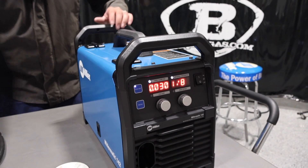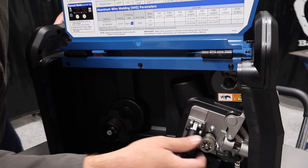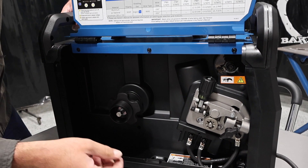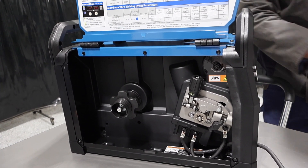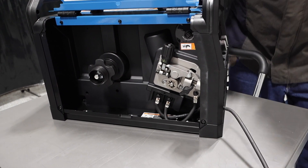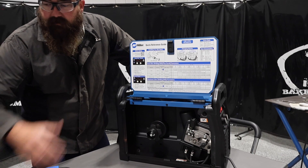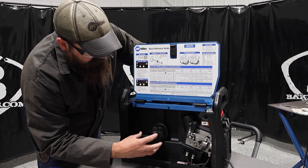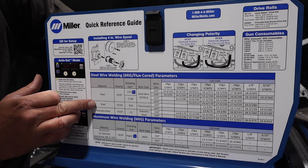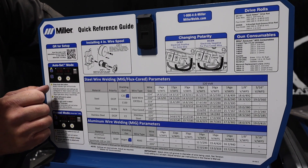Let's dive into the side panel. We have our power block, our drive roll, the idler wheel, and our tensioner — this clamps down on the MIG gun. We've got our ground cable in there as well. This unit will hold an 11 pound spool or a 1 or 2 pound spool. There's a nice chart up here with recommended settings — what gas to use, voltage and wire feed speed for different material types. It covers all the way up to 3/16ths, which is the maximum this machine can handle.